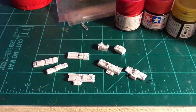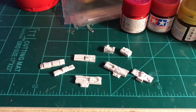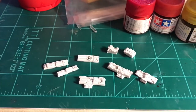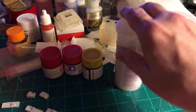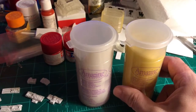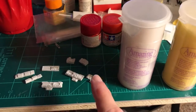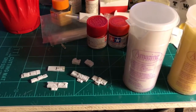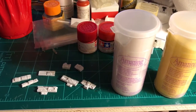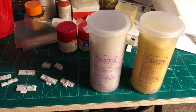So I went out and got some more mold material. Decided to try something different, mainly because the one that I was using takes a long time to harden, usually overnight. So I'm going to go ahead and try a putty, mold putty. And it comes in 2 parts, and it's a solid putty. You mix equal parts and just press it against the part, and it's supposed to dry in about 15 to 20 minutes. And then it's supposed to stay flexible and be ready to make a mold. And they do advertise that you can make resin molds in it.